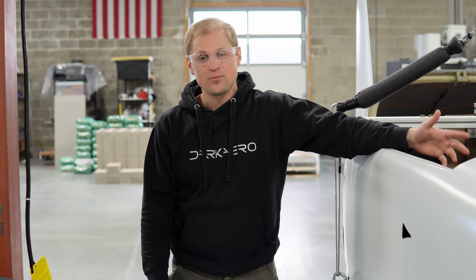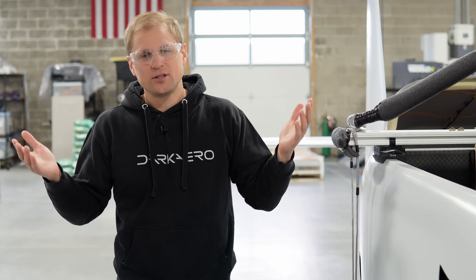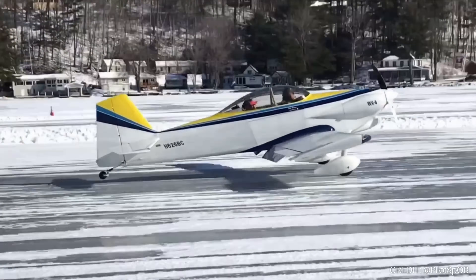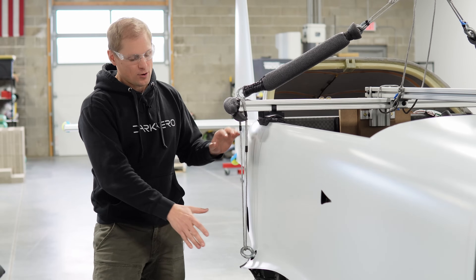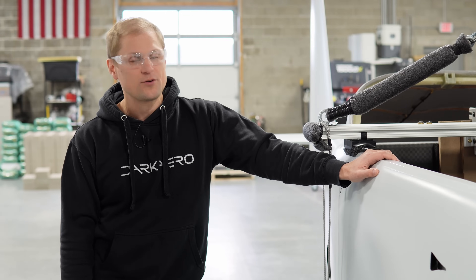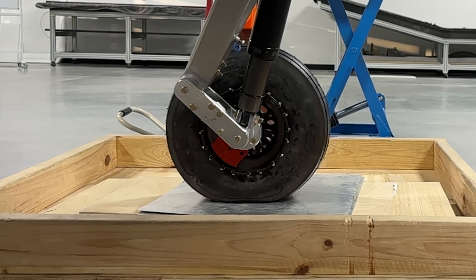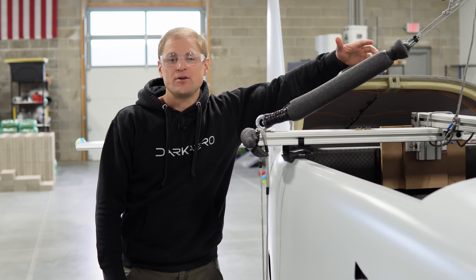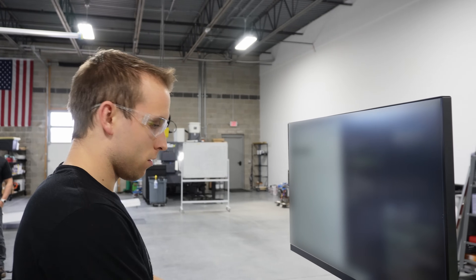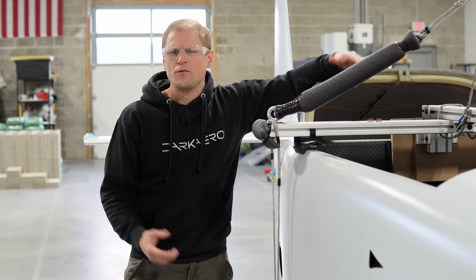We also have greased skid plates under each main landing gear tire so that when the landing gear contact the ground they can splay out — simulating what the wheels would do anyway by rolling outward, and also simulating slippery wet pavement or ice. Allowing them to splay out imparts the maximum bending moment into the structure and gear struts. The platforms for the level landing with inclined reaction loads were built up with cinder blocks, a plywood platform on top, and a 2x4 perimeter to keep the wheels from rolling off. Inside the fuselage we had sensors to measure acceleration or g-load during impact, as well as drop height and pitch and roll attitude — all recorded to a computer so we could review the data and understand if we were hitting our target g-loads.